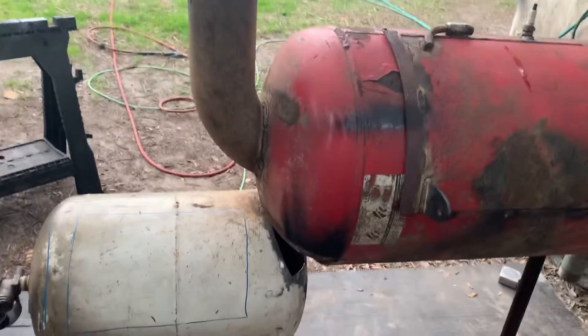Because this is a cylinder and you cut it open, it's under tension — when you cut it open it wants to spring open. I tried my best to bend it back, but I think what I ended up doing was just flattening the middle piece and didn't really get it back to original shape. So I've got a gap here and a gap up top. That is why you also want to run a slab piece of metal on the edge to give it that closing effect, just so it closes and you don't have a big gap everywhere. I did this on the bottom and on the top. I've got the smoker up on the workbench so I can work on it easier and don't have to bend down. It's a little cold here in Florida — it's like 50-something — and my knees start hurting when it gets cold.